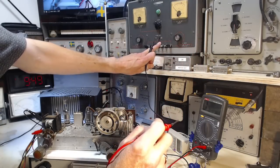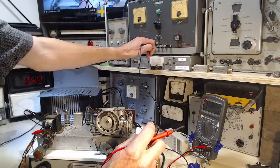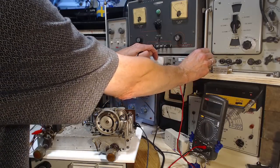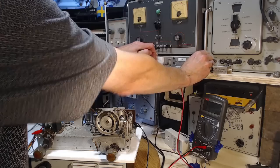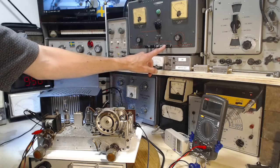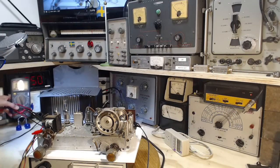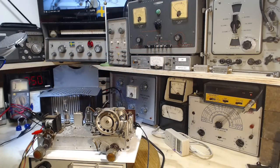But I don't normally connect here. I connect to this terminal, which is marked as common, separate from ground. And inside there's a dotted line. So what does that mean? Let's check here. I've done this before, but I've got to do it again all the time. So it's nothing. The dotted line indicates you could connect these and introduce a power system ground onto the negative terminal of the high voltage supply here. But normally, no, there is no connection back to the power system ground or the neutral in my house from this terminal. That's pretty important to know.